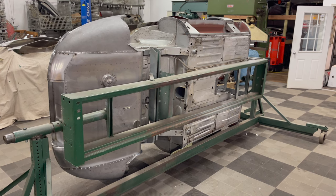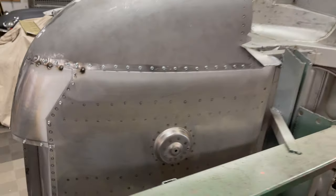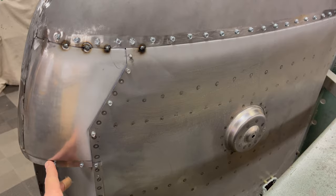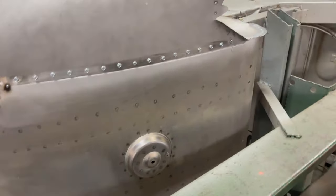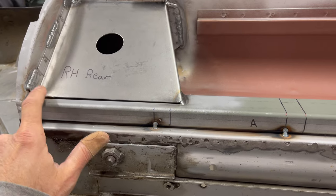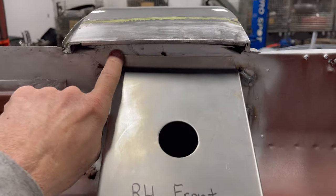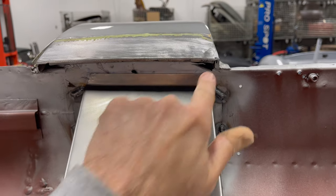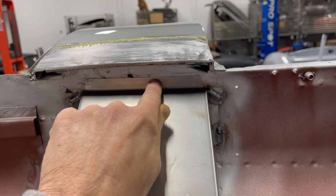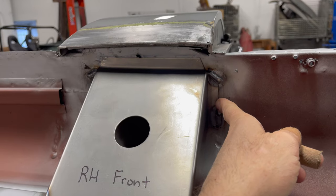There it is flipped up — I figured you guys would love to see this shot. This is what I've got to finish up. You can see I've already done some spot welding here. I'm going to pull these screws out, weld up all these holes, and then grab the spot welder and do some more plug welds. Here's where I'm going to finish out this section — I'll weld along here and just tap this down some with a hammer. And over here, weld across the front. This is a little messy from the dissection we did, but I'll do some stitching in on the edge. I'll also drill holes here and put some plug welds in because having welds along that face will make this stronger than just having the edge welded.